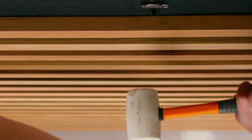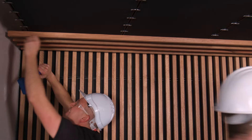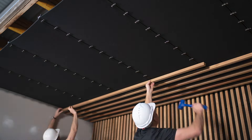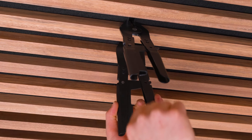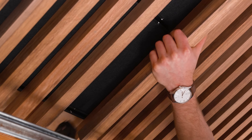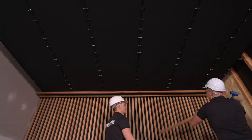The alternative is a white-faced rubber mallet. When installing the battens, be aware of any access hatches mentioned in the plans. Continue the installation of the battens until you've covered the entire ceiling. To remove the battens, use our batten removal tool provided with every order. Use the tool to separate the track by putting the tool's prongs into the track throat — squeeze until one click is heard and gently pull on the battens to disengage, and the batten will then come freely away from the track.